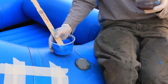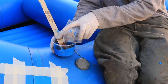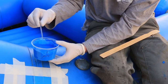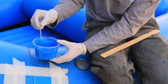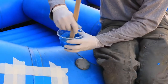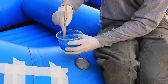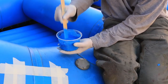Step 3: To mix the urethane, pour equal parts A and B into a clean container. Measure accurately — a graduated 1 gallon plastic bucket makes for a good container. If System 6 Accelerator is included in your package, empty its full contents into the mixing container. If you are only using half of A and B, then only use half of the accelerator. Thoroughly stir the mixture vigorously for at least 5 minutes — this is important. Be sure to scrape the sides and the bottom of the container when stirring. Do not mix more than can be applied in 45 minutes. Apply the urethane immediately. If urethane is too thin, you may let it stand for 10 to 15 minutes.